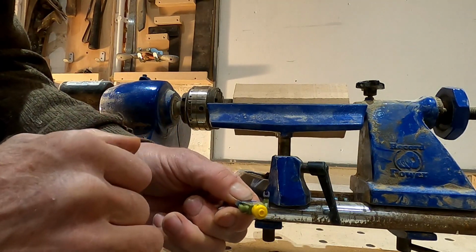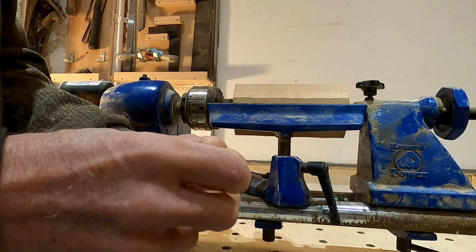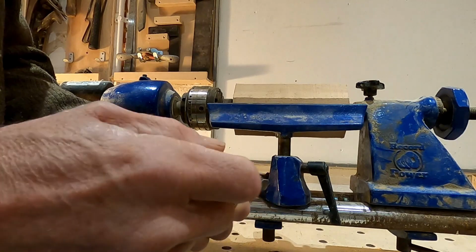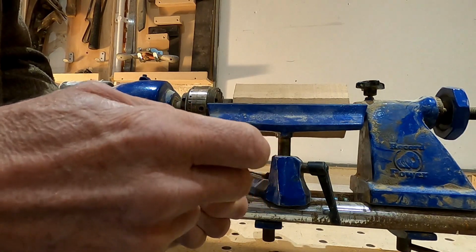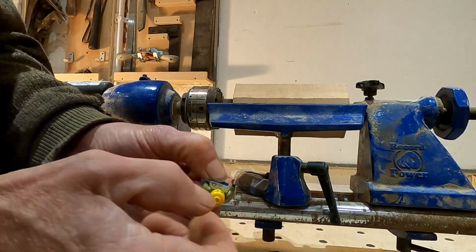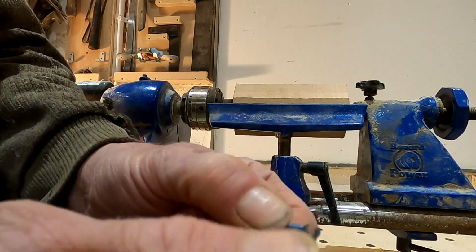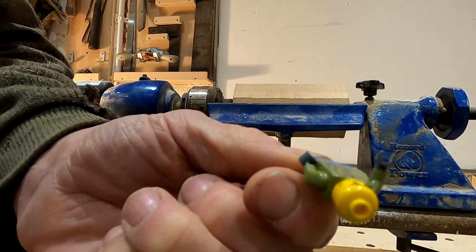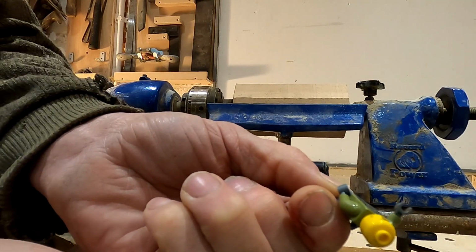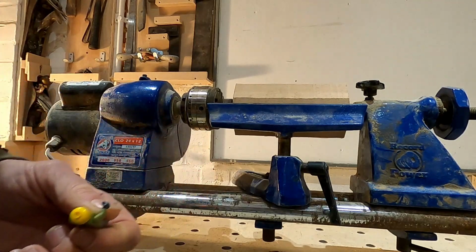They're quite big. So I thought, as the lathe is out from doing the head, I'll just make a circle, like a big disc, and then I might try and either take the middle out on the lathe or just cut the middle out. So it's basically a circle with the front cut off, and there's a little pin that goes off of it. So I'd better make that on the lathe, and then it's just the handle for the lightsaber to make on the lathe as well. So I'll get this all turned up and come back and show what I'm up to.